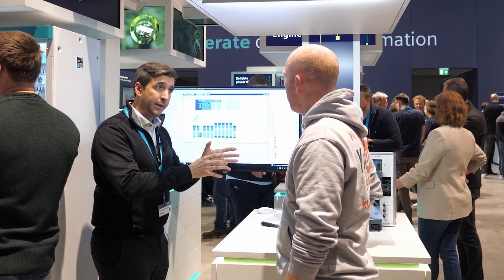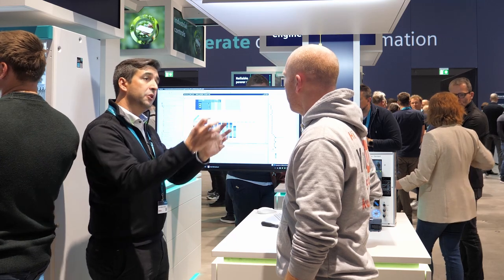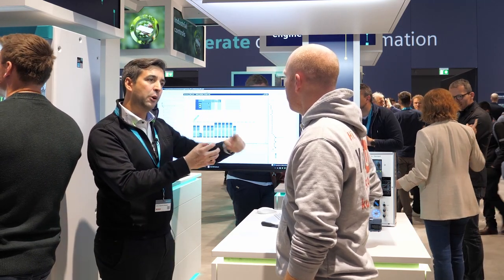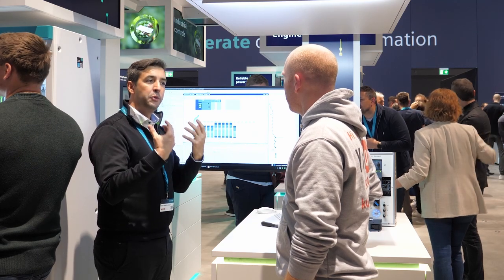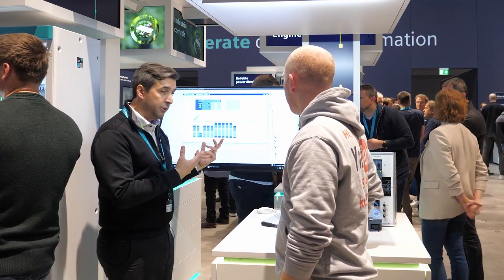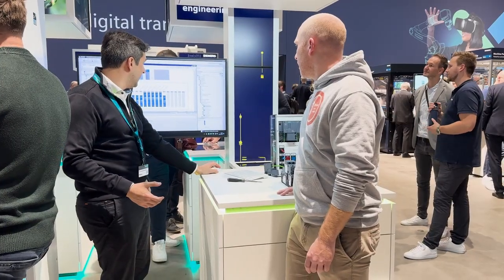If a module gets broken, you take the new one from the box, you set it there, and the configuration is stored on the PLC itself. So the PLC sends the configuration to the module automatically. So you don't need any special know-how for maintenance either. No. You even gain a lot of diagnostics. So setting up the device is quite easy.